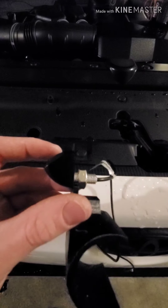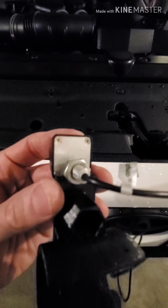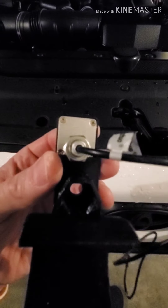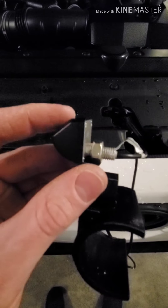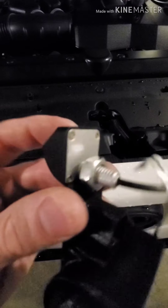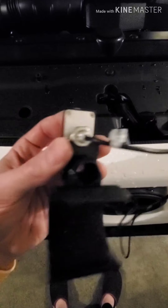This is an important step. Outside of the bracket itself, I've threaded the nut down to see where I need to line it up. If you can imagine, this nut can be positioned in this hex spot in one of three orientations — technically one of six, but they're duplicates. We need to know which side of the nut wants to be flat forward, because I'm going to be threading this camera into the nut. If I do it wrong, my camera's going to tighten up at the wrong spot. So you need to tighten it down until it cinches up, then take a sharpie and mark that flat side, and drop the nut in in that orientation so when I thread the camera in, it'll line up.